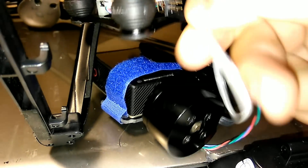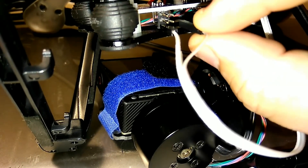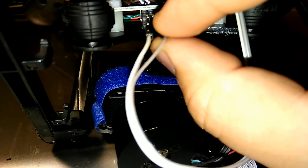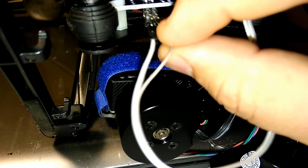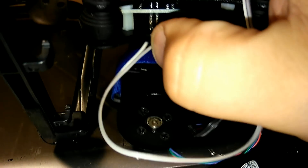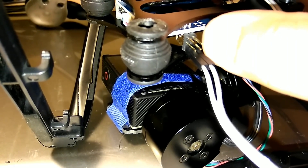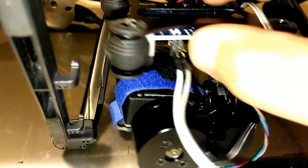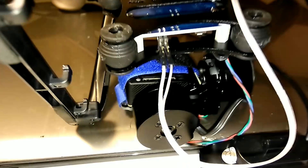If I were to remove these, you can see there's only just a pin at the bottom. All you're doing is putting both channel wires into the lowest possible pin on the board and pushing them in tight. There are only those two pins exposed on the top, and then you know you've done it right. Now you just need to look at your color coding for the wires — this one is gray and this one is white.